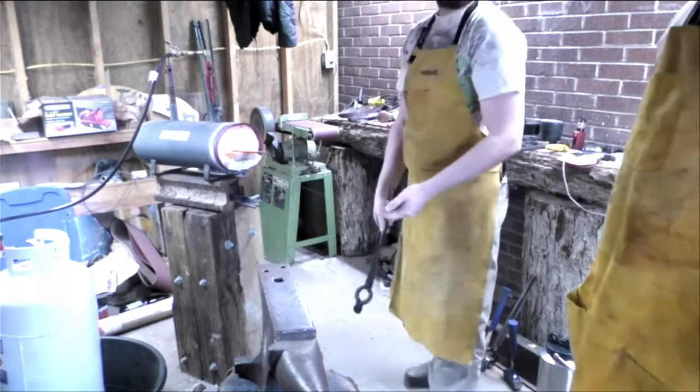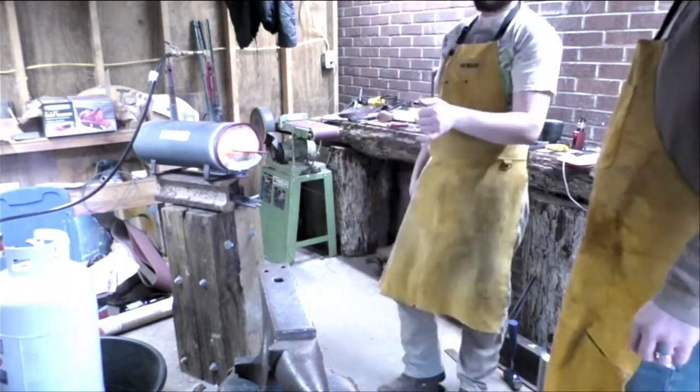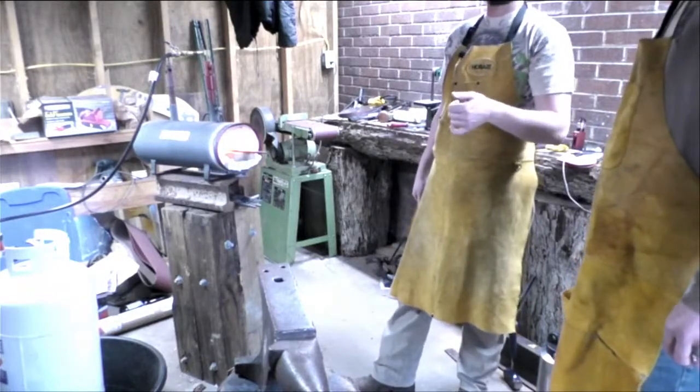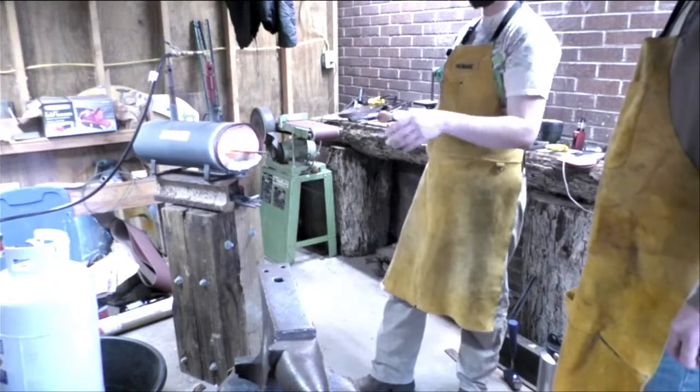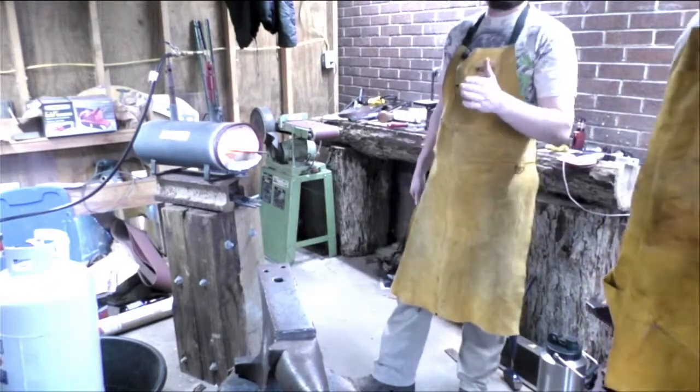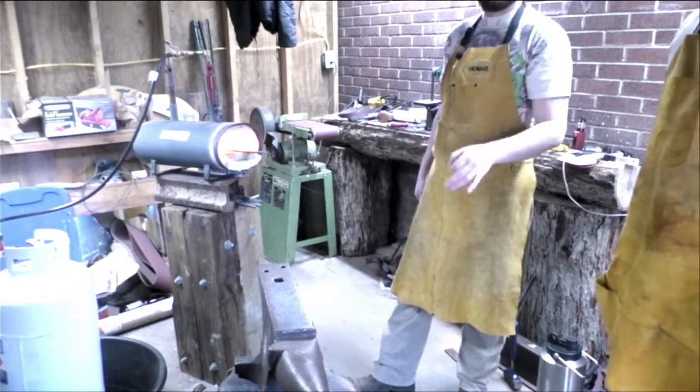Whenever you end up making your own knives, when you start looking at it, you can see crescents in it. It means that you're rolling your hammer a little bit, and you're hitting it a little bit too much with the edge. So I use a ball peen for now until I get it flatter, to bring it out, because it stays really true flat.